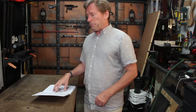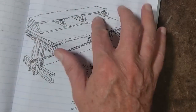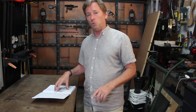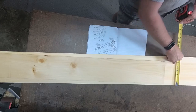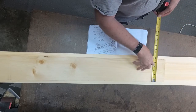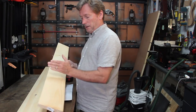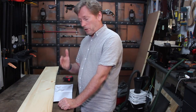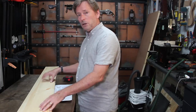Going off my basic plan, I need to build the top piece and it needs to have side pieces. I'm going to push that out to the edging of the door to help support its strength, because that's where most of the strength is with the door. I picked up a 1x8 — which is 7¼ inches roughly — and a 1x6, which is about 5½. I'm going to use the 1x6 for the height of the shelves, cutting it at an angle so I can slice and reverse pieces to get as many as I want.